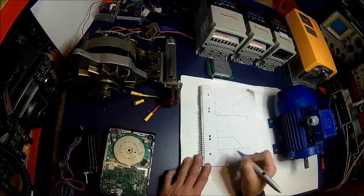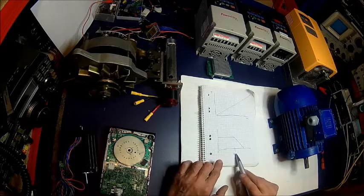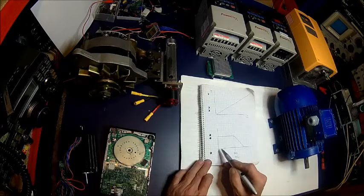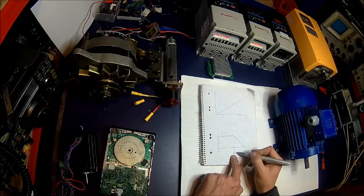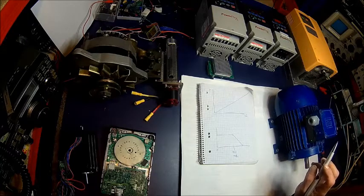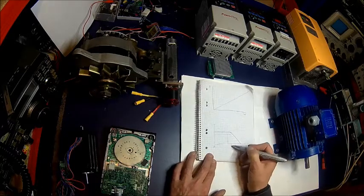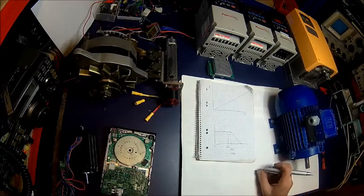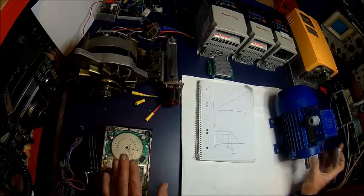For understanding purposes we'll stick to that torque curve for now. When you switch the motor on it will have almost rated torque and run up to rated speed. You could lower the voltage and the torque will drop, pulling the speed down to maybe 800 RPM, but it's difficult to control three-phase AC voltage — there aren't many variacs around to do that. So what we do — and this is the whole subject of this series — is use an inverter drive.